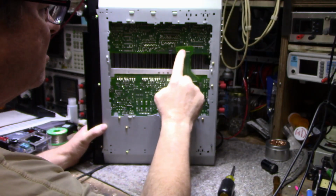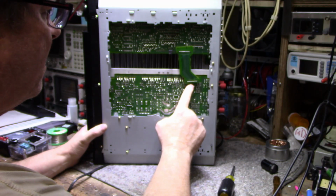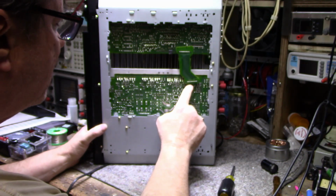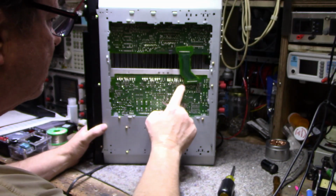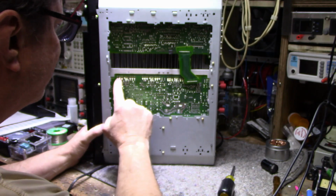And then they're using a jumper board run from here to here, and I think they're bringing three channels across. You got three sets of wires, and this is probably doing amplifier driver over here, and then these are the output devices. Doesn't look like there's any drivers here, but then we have Darlingtons, right?